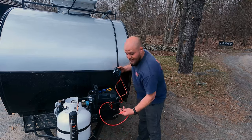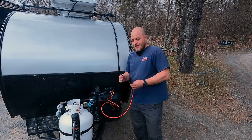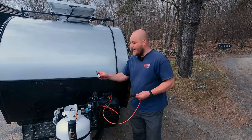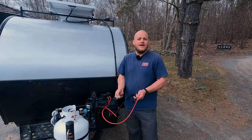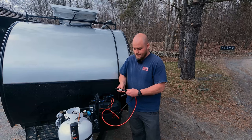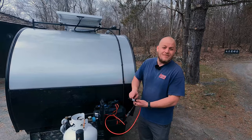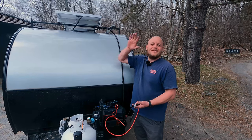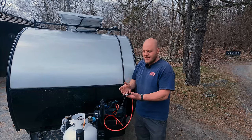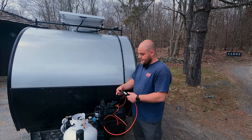Since I have the MC4 connectors connected to the end of my solar panel I'm ready to do the final installation. If you've never done MC4 connectors there are a ton of videos on YouTube showing how — it just takes a minute. I'm going to use this Bouge RV inline fuse — it's really easy to swap, it's 30 amps, just plugs into the positive side and clicks in place. Now my battery is fused and my solar panel is fused. Best practice is to always plug in your battery first and throw a blanket over the panel or turn it into the shade — it's a safer job to connect when you're not in direct sunlight.